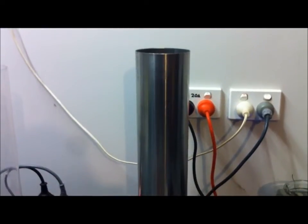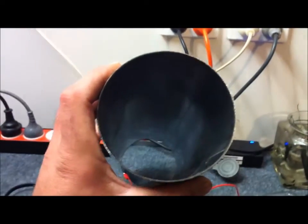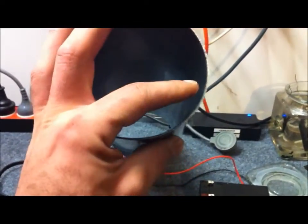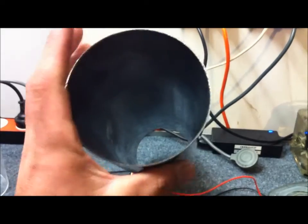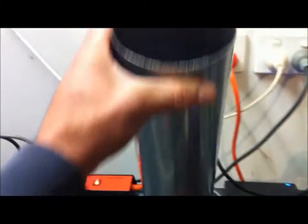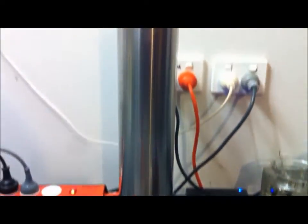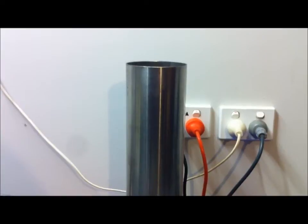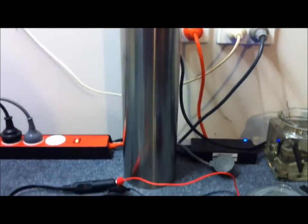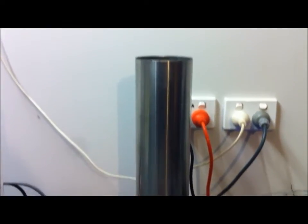What we have here is the main piece that was going to be used for the vacuum chamber manifold. We're not going to be using this anymore because during a final design and weld prep meeting with my welder, he expressed concern about the 1.6mm wall thickness of this tube — worried it could deform with the heat. So we've decided to use a Schedule 10 piece of pipe instead, and we'll machine it down to get the surface finish, since you can't get polished scheduled pipe. We'll get a heavier wall thickness, less distortion during welding, and it'll be machined down to the same level of shine. Bit of a setback, but it's in progress.